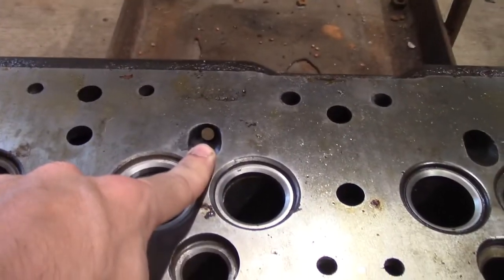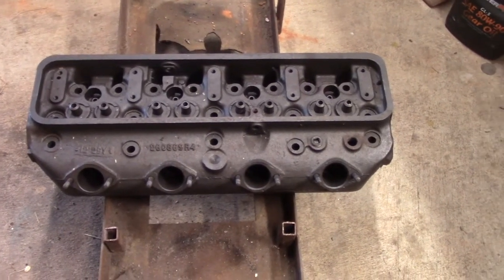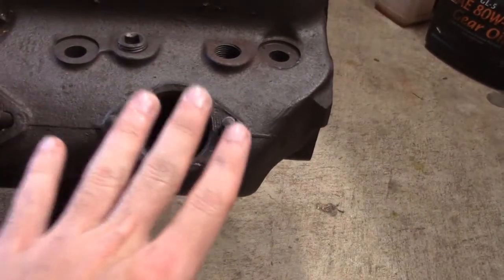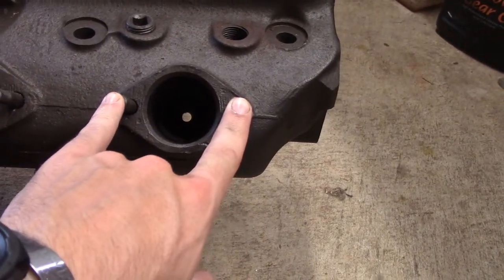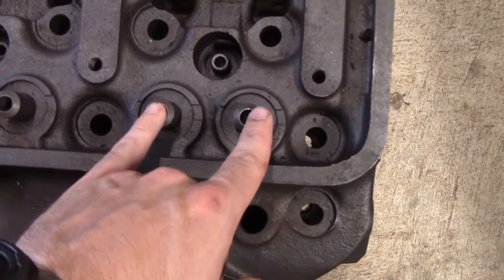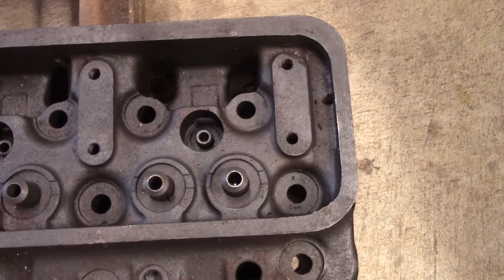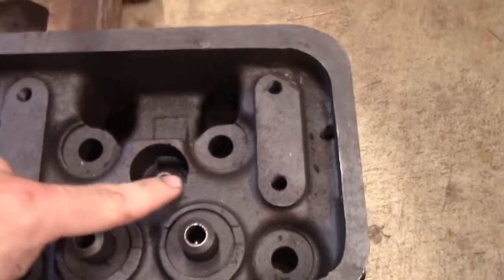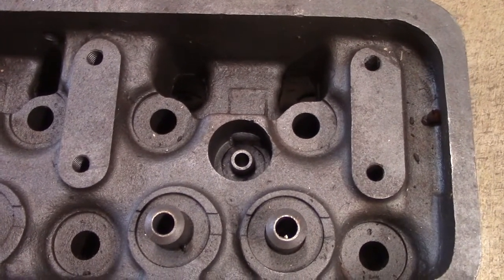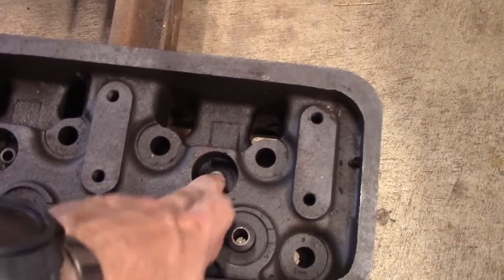These ports here are for your injectors. With this being a bare engine head there are a few things you won't see. Down inside your injection bores you will have injection pre-cups that go down in there, followed by a sealing washer, and then your injector goes down in there with an o-ring that seals against the bore and nuts that hold your injector down tight against the pre-cup and seal everything off. You have your intake and exhaust valves here with guides and a small recess for your starting valve. When the starting valve is fully assembled there should be a small cap on top that rides on the end of the valve stem — I need to put those caps on to make sure the starting valves are depressed appropriately when switching between gas and diesel.